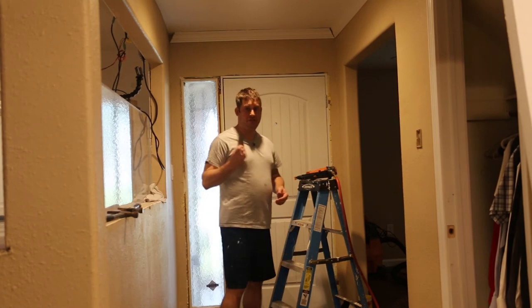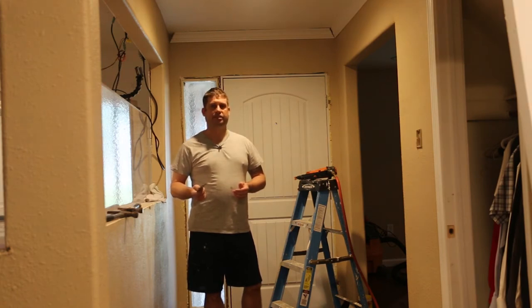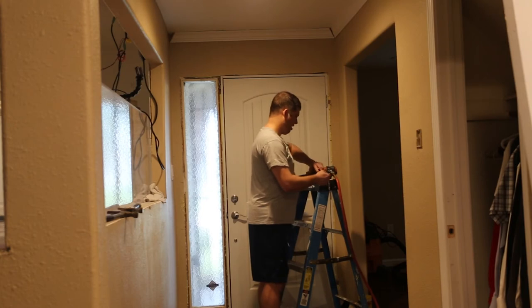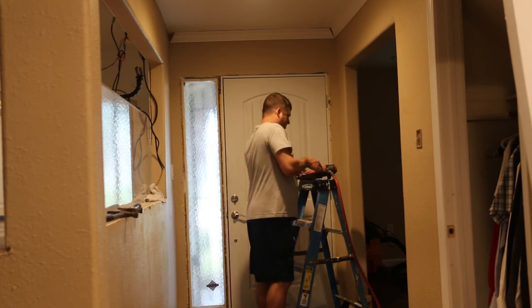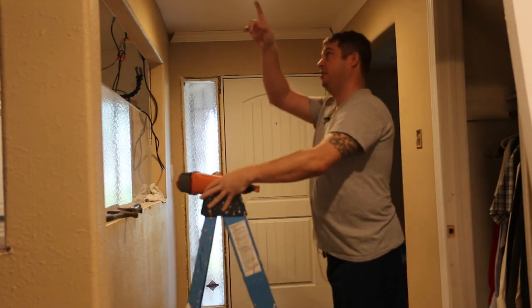These are 15 gauge nails — they're about $20 for a box of a thousand at Home Depot. If you go on Amazon you can buy a package of 700 for about eight dollars. Beware of the finish though — they have galvanized nails and plain steel nails. This is inside in a humidity-controlled house, so I really don't think the galvanizing is a big deal. If you were doing outside work, the galvanizing would matter. You just got to watch your costs on stuff.